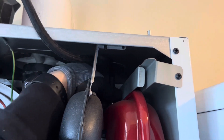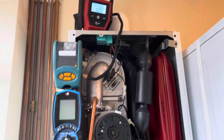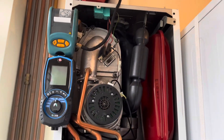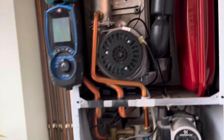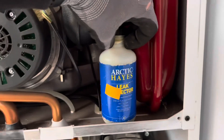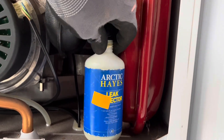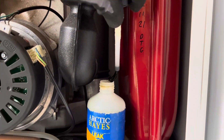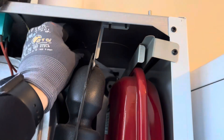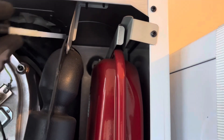Removing the hose. Now I'm going to take about five minutes trying to get my leak detector out of my bag. Get a bit of leak detector and put it on the Schrader valve to make sure it isn't passing — it would bubble up if it was passing.